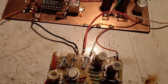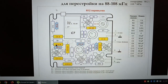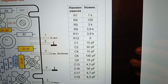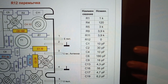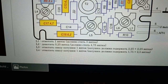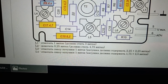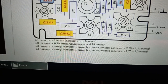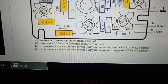Here are the modifications required to convert this Selena block. You can see the modification of the coil components to work in the 88 to 108 MHz range. For L1 you need to remove one turn, for L2 you need to add a quarter turn (0.25 turns) — I will not modify this one as I don't think it will change much. For L3 you need to remove one turn, and for L4 you also need to remove one turn.